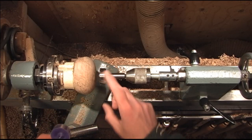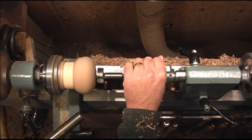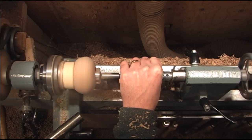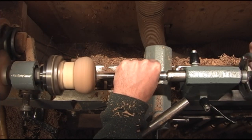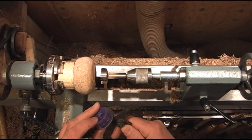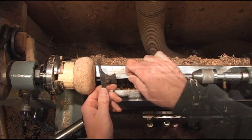The tea lights are inch and a half that I'm putting in, so I'm using the inch and a half Forstner bit. I'm just going to put it right into the center there. Check the depth real quick — these are right at three quarters of an inch, so I'm going to go ahead and set it to that. Any piece of wood that's an inch thick or even just a little bit over an inch will work with any scraps you have laying around.